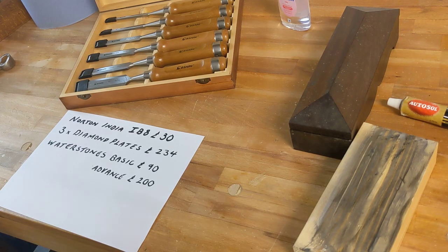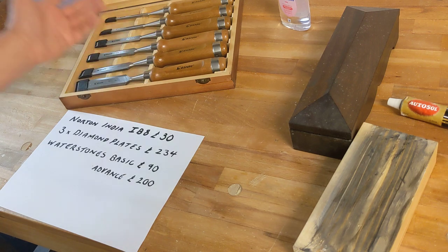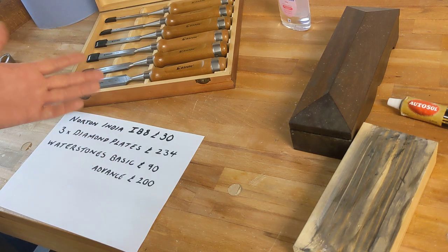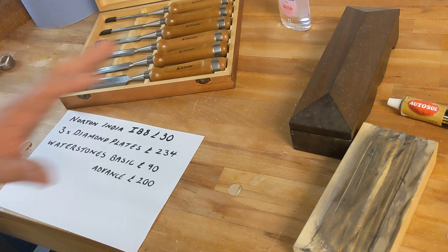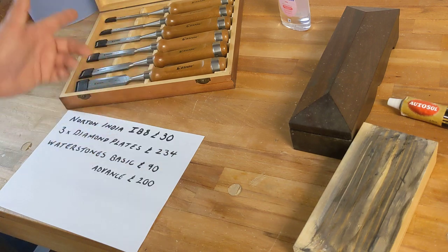So you can see with that initial video, it's super quick how you can prepare these chisels. I picked the budget option, mainly because I think picking really expensive stuff and showing how to set that up isn't really necessary. And if it's really expensive, my personal belief is that you shouldn't have to do anything. You literally raise a burr, remove a burr, and get to work, which is kind of what I've done